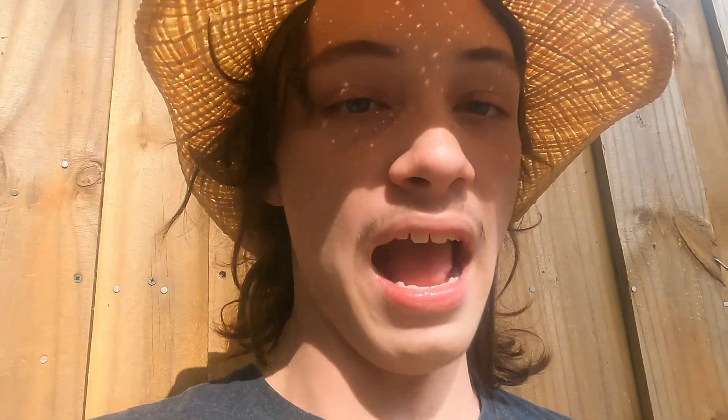With the radio out of the way, let's talk about the antenna. There are many more complicated ways to make a shortwave antenna involving coaxial cables, grounding, balun adapters, complicated loop shapes, and tuning to specific frequencies — but that's not the kind of thing you can do with random stuff lying around the house. That's where this antenna comes in. This is what's known as a random wire antenna — it's just a random length of wire going from one high place to another. The idea is length doesn't matter; you're just trying to get as much wire as high in the air as possible.